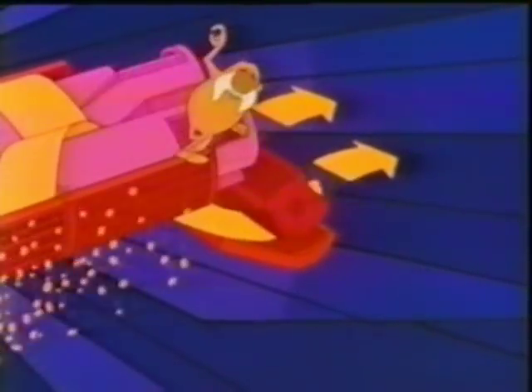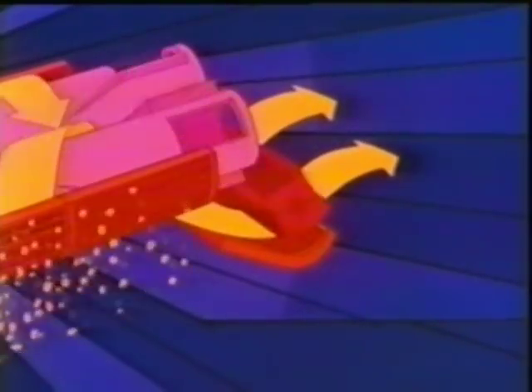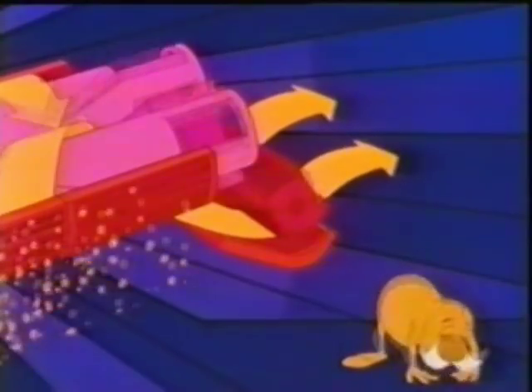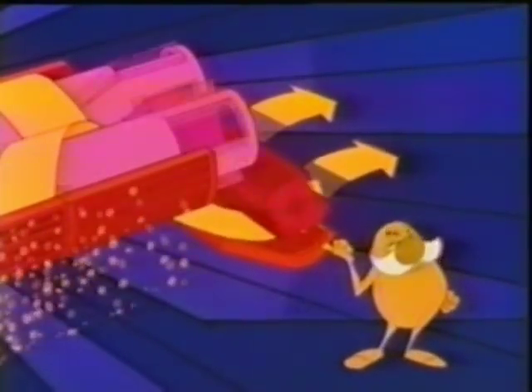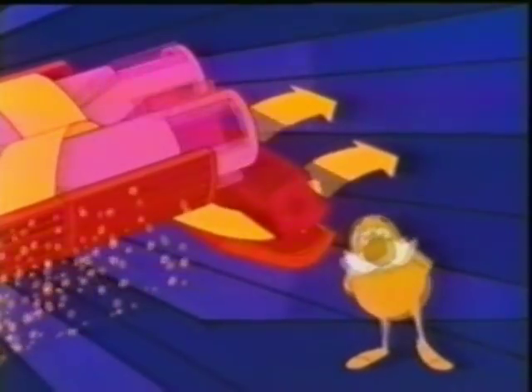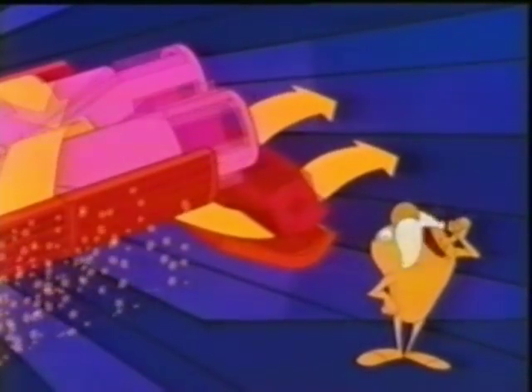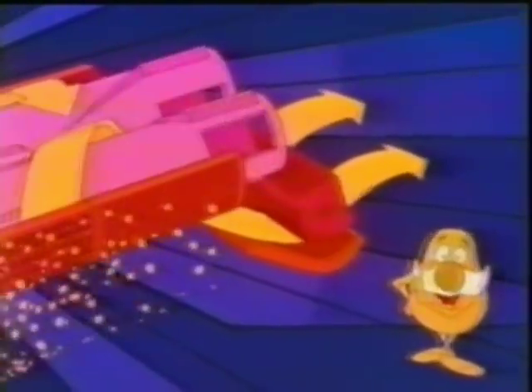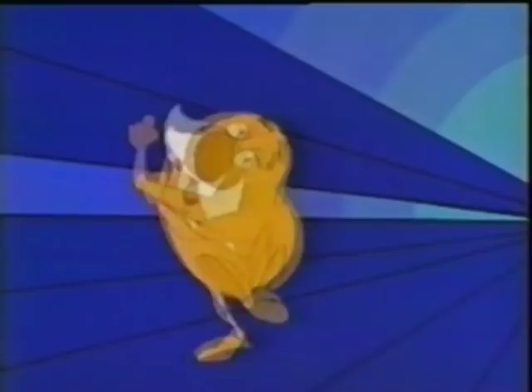But even these separator grates are not the end of the line. To catch that last little bit of grain — that was the discharge beater and grate. Only Sperry New Holland has one to save valuable grain before throwing crop residue out the back. Now you've seen how the crop passes through the twin rotors, but I haven't yet shown you the really important things that go on inside those tubes — like centrifugal force!